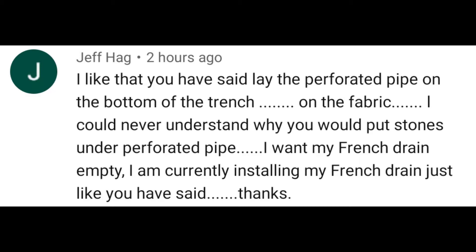So that was their fix for that. Instead of spending the money on a good drainage fabric, they would just put three inches of stone down and put the pipe over it, knowing that the clay was just going to come up through that three inches of stone.